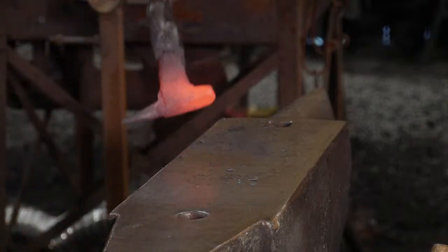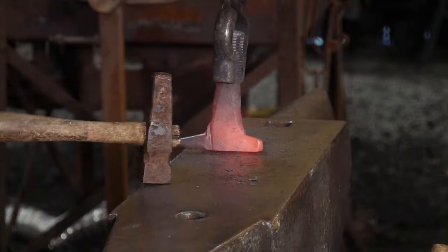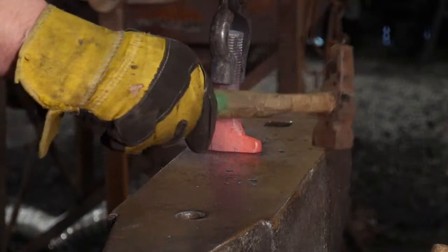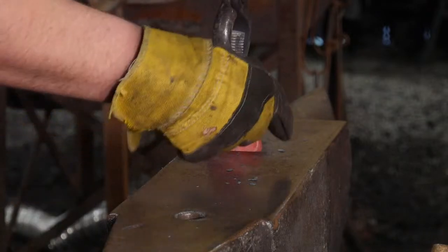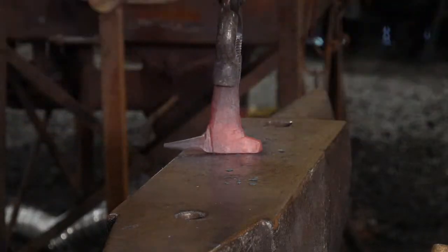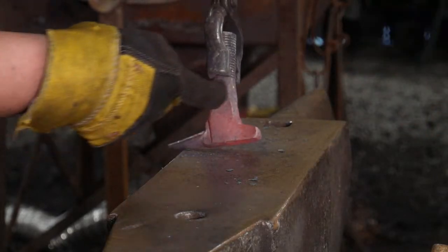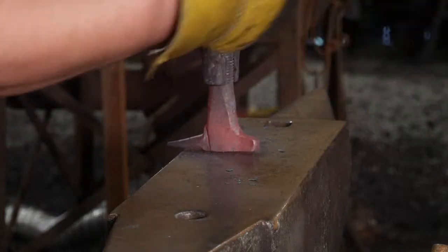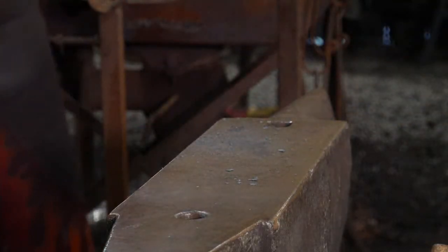Okay, hold up. What I'm going to have to do here is switch tack. This square is okay, but it's not really driving out the amount of material that I want. So I'm going to come in with a fuller tool to help push that material out further to where I want it. I see a crack that I want to take care of. Yeah, it's going to be in there. We're going to have to drive this out more before we can take care of that. Okay. So you want to hand me the